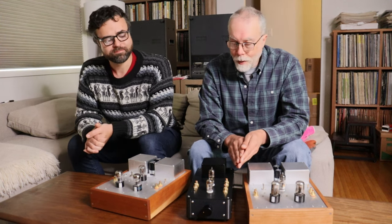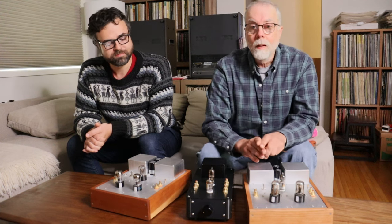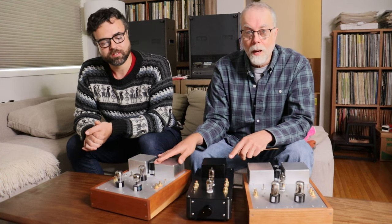Sometimes they'll have an insight as to what they're hearing and why they think it sounds so great. So that's coming. Now, if you have already built a classic line Universal 6 or 12 SL7 phono preamp, you can upgrade the cathode follower with a 6N6P and a nine-pin to octal adapter.